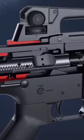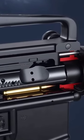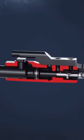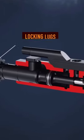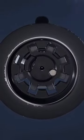As the carrier returns forward, the bolt strips the top cartridge from the magazine and guides it into the chamber. Housed within the bolt carrier is the bolt, which contains several locking lugs that engage with the barrel extension lugs. As it makes contact with the barrel breech face, the bolt turns and locks.